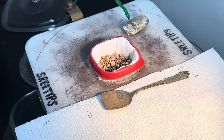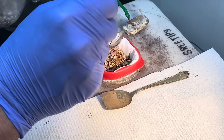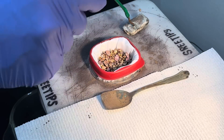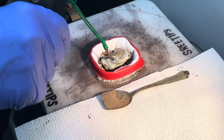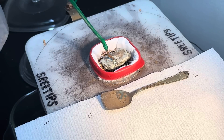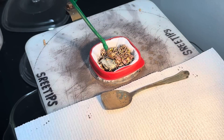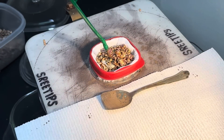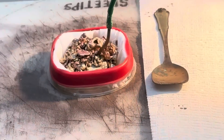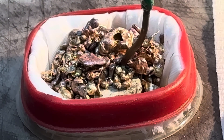I think we've got a long way to go here — we've got lots of room in the cell. So I'm going to go ahead and fill this basket up. Let's go ahead and put this in now. The power supply is on up there. I'm going to put the anode electrode bar in there and cover it with some shot just to make sure to get the best current flow possible through the cell.